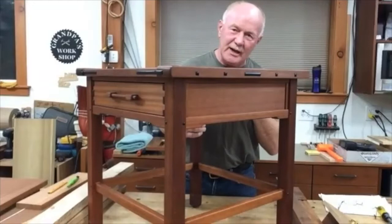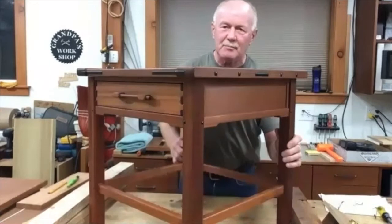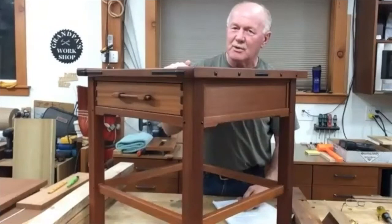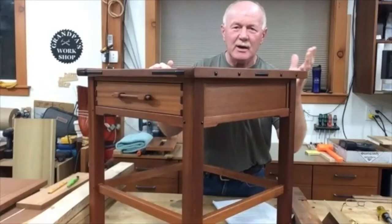So what I'm going to try to do tonight is just really highlight a catch up on the bullet points from that presentation, and then pick it up from there and get more into things like marking and running the mortises, drawer joinery, glue up strategies, breadboard ends, and see how far we can get into some of the Greene and Greene specific details. I'm kind of wanting it to be more generic joinery glue up processing issues that would apply to any style.